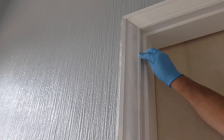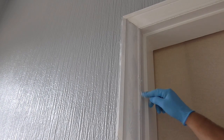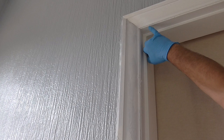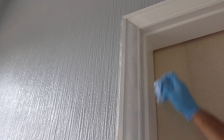So if I need to touch up with the BIN primer, again, the BIN, then I will. So this has already been backfilled. I just need to fine fill it really now at this stage. And I don't want to completely fill that up either. Just as long as I follow what is here, it'll be alright. A damp cloth will just help smooth it off.